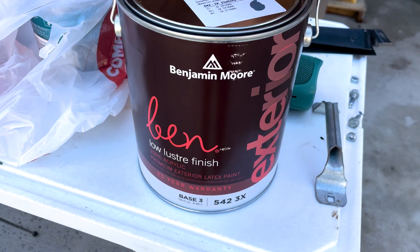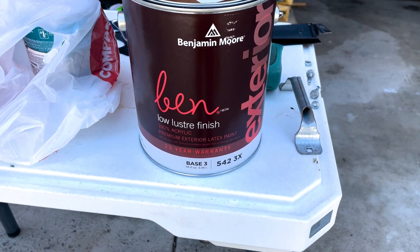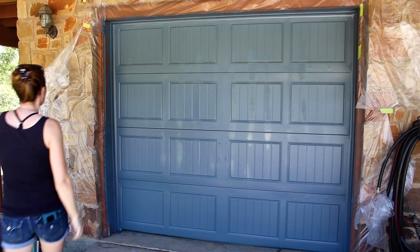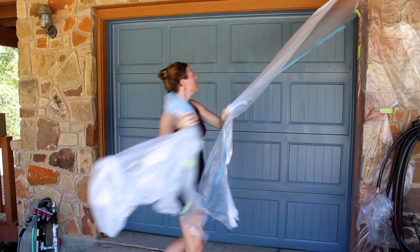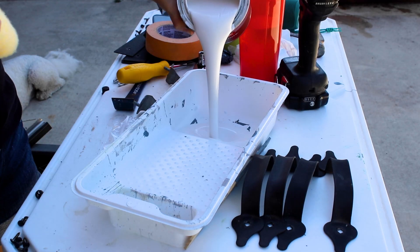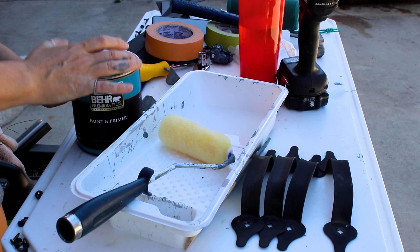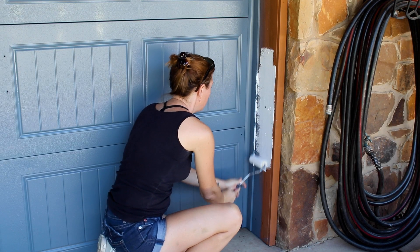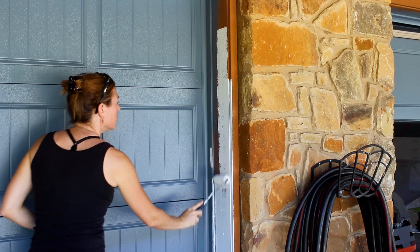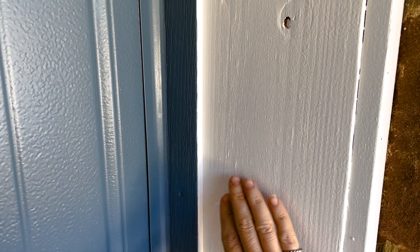As for what kind of paint — it isn't anything special. Any exterior latex paint will work great. After letting that dry completely, I ripped off the plastic around the doors, then started on the final painting step, which was painting the trim. It's at this stage you'll see me go over all of that blue overspray from the previous step. I personally left my weather stripping and its trim piece blue, but another option is to raise the garage door and paint it all to match the trim instead.